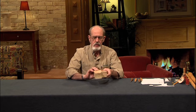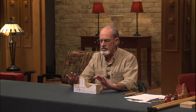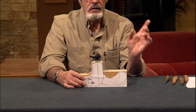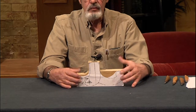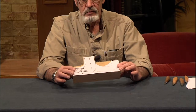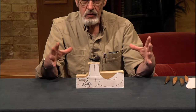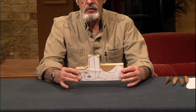The first part is to take a block of wood approximately an inch and three-quarter to two inches wide, about nine inches long and five inches deep. I'm going to show two means of connection when it comes to attaching the cane shaft to the carving. Sometimes you can't always find that thickness of wood, so in many cases I'll laminate two pieces together — whether it's walnut or any other species acceptable for your carving.